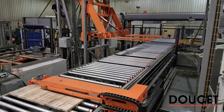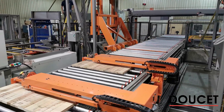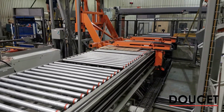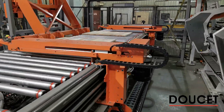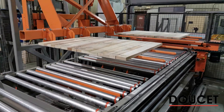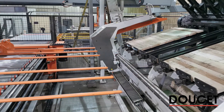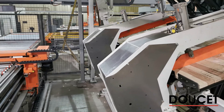We can see the loading device has technically unloaded the panel. As soon as we're ready, we ship those two loads into the loader zone. As soon as the grippers clear the way, the loader takes the loads and loads them into the clamp carrier. There are two RT100 tighteners on this clamp carrier, so that both loads can be tightened simultaneously for a quicker cycle.